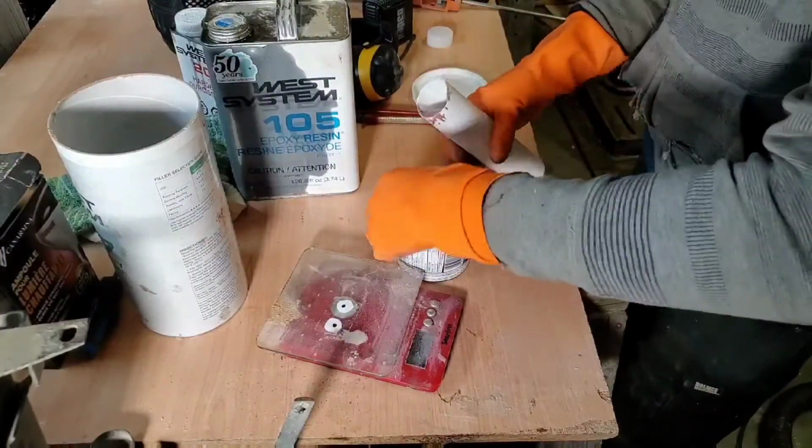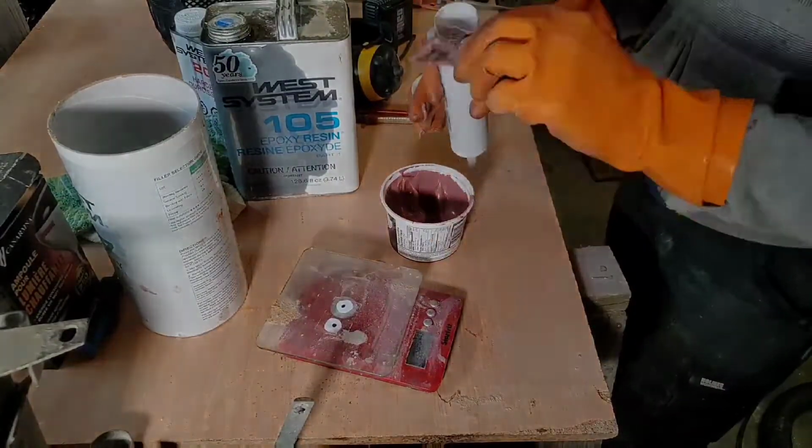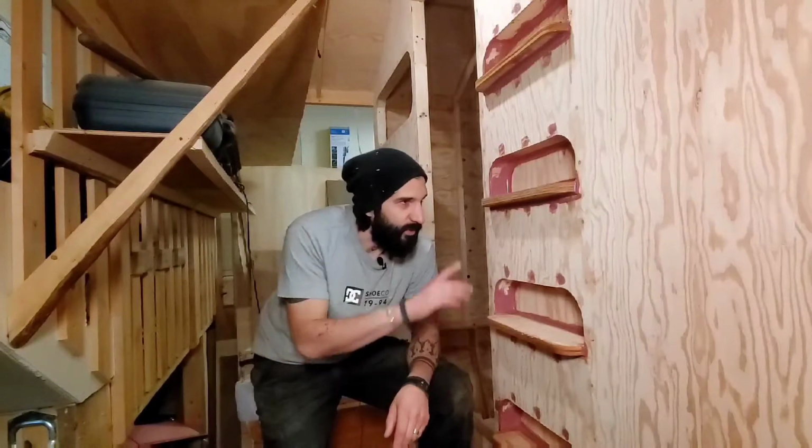For example, there were a couple ugly knots on the plywood backing. Basically I tried to smoothen everything out. Unfortunately, this did not go the way I wanted it at all. I think there's a couple of things that went wrong here. First is that I ran out of filler material. What I tried to do here is producing an easy to sand fairing compound. And for that purpose, you usually aim for a peanut butter consistency. Mine was a little bit more runny. So you can see on certain spots the epoxy is sagging.